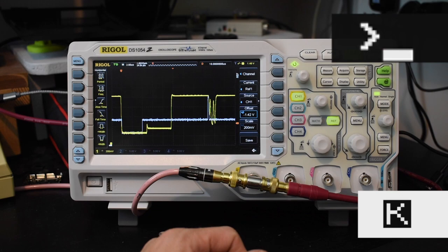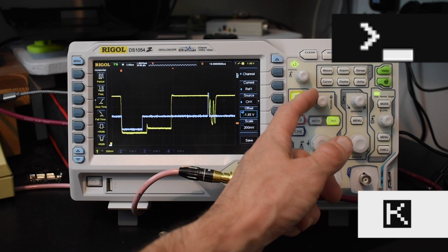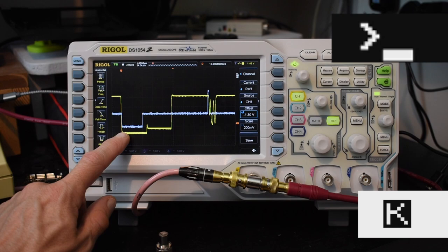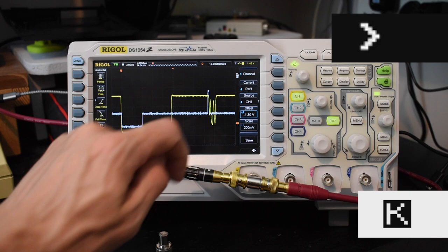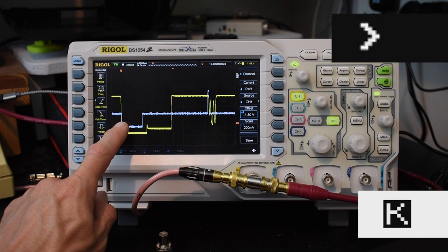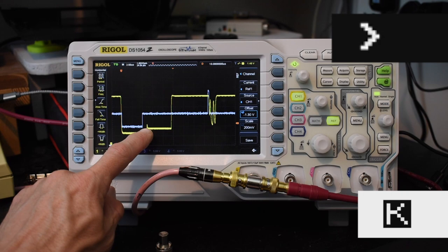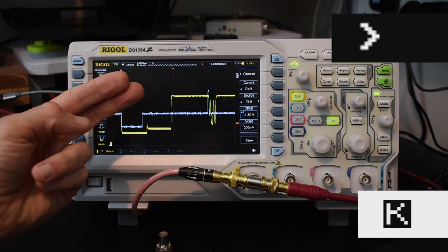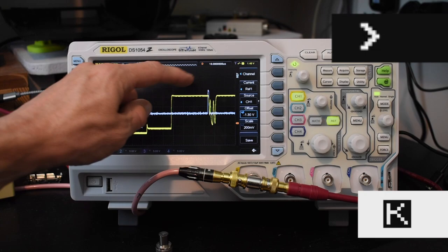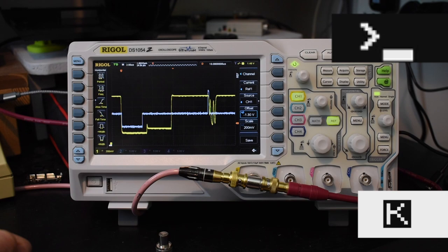Now I'll bring up the BBC's waveform so you can see the difference more clearly — the BBC's in white and the ZX81's in yellow. Looking at the BBC signal, you have a nice sync pulse at the start, then the voltage assumes a level, jumps up for a bit of the prompt, then returns. The sync pulse is a little shorter than the ZX81's but apparently that's within spec. Looking at the ZX81, you've got the sync pulse but then a weird little step, then the voltage jumps up, sits at the top level, and dips down for the K. The reason it's the other way around to the BBC is because the ZX81's screen is white with black pixels for text, whereas the BBC is black with white pixels.